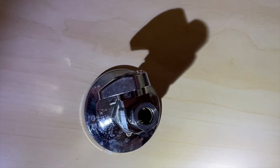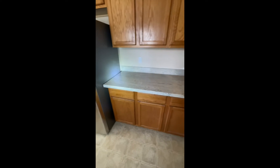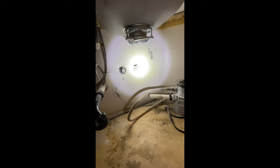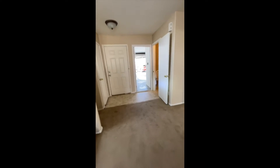Brand new valve on the sink and it leaks — why does this happen? I'm here in a rental unit we own. We just got brand new granite installed, but the granite guy never hooks up the plumbing again. These are old water valves, and old water valves should always be replaced. Anything over five years, I would replace. The project here is to replace eight valves in this house — there was one actually dripping in the kitchen.